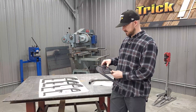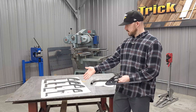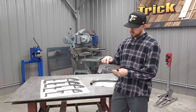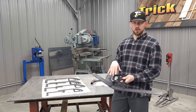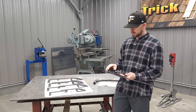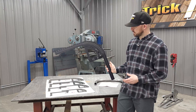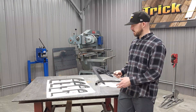There's not a whole lot to them — real simple. They come packaged here with the hardware and everything, so it's a simple process to put them together. There are little nylon washers between them so you can move them without scratching or marring. Once you get those loose, you can put it where you need, line it up with the angle, and snug it in place. So there's your 90 degrees on an eight-inch radius with this big bend protractor.